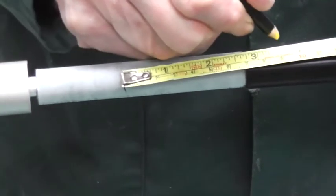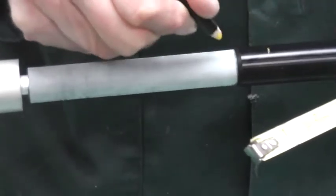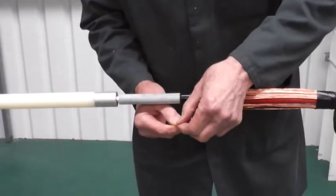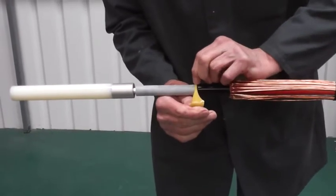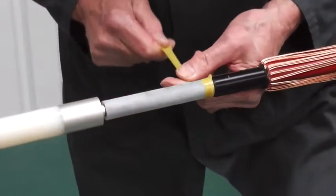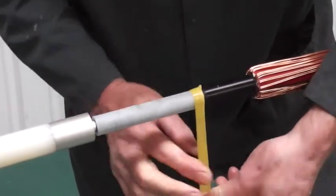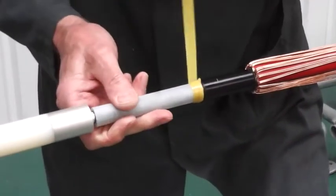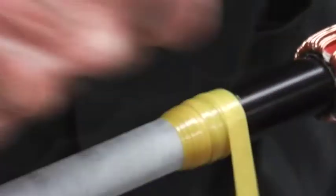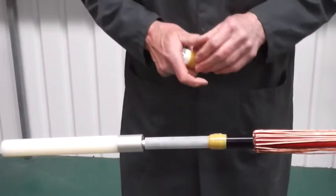This is an insulating rod with an applied screen on the outer surface. Now again mark the cable according to the instruction sheet and we're going to apply yellow stress-relief mastic tape around the cable screen point, 10mm onto the primary insulation and about 20mm onto the semi-conductive layer.